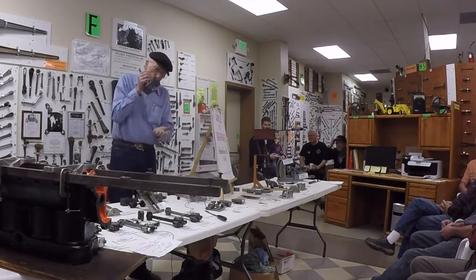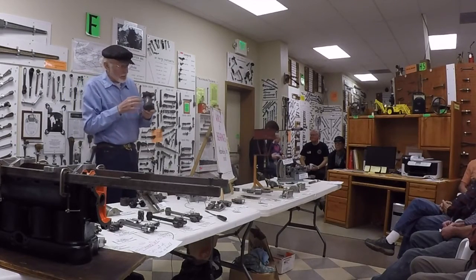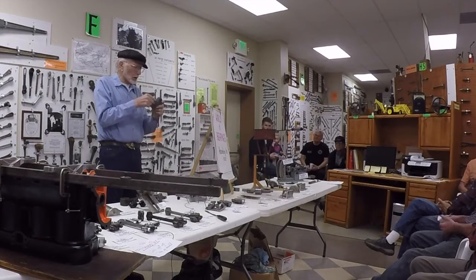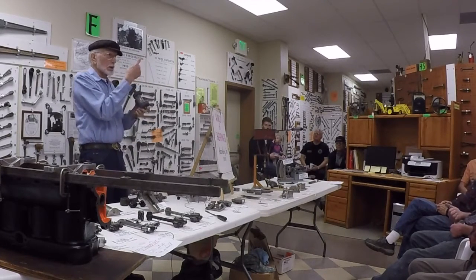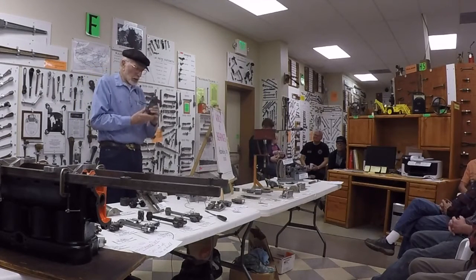But this would go down in a Model T cap, and it's got an oil distribution groove in it. And the one that's up in the, this is the cap. The one that goes in the block's got a little different shape, because that thing has to jog over and pick up the oil hole that comes down from the valve cover or valve belly. So the main cap sits in there, get her all sucked up tight,